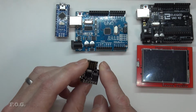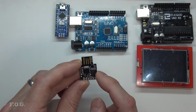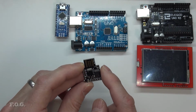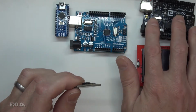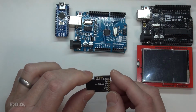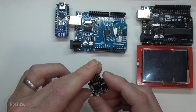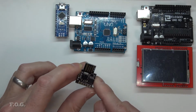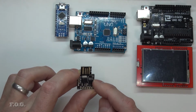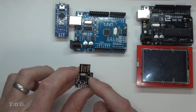So in this form factor here, the way they make it work is, again, they need a bootloader, something that talks to the programming software on the computer to write the information in here. And as you see, we have the ability to plug on the USB, but there's no communications IC. There's no dedicated communications IC, and that's a problem basically. So the way this actually works is that they've actually programmed the USB communications behavior into the software in the bootloader, as well as the programming behavior.